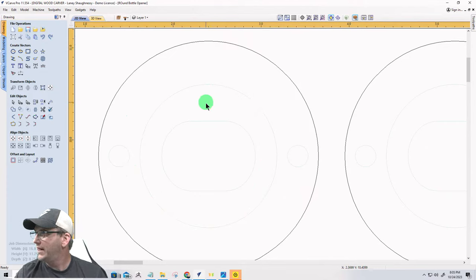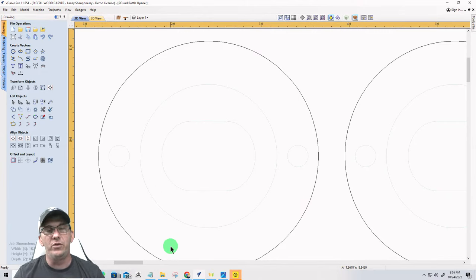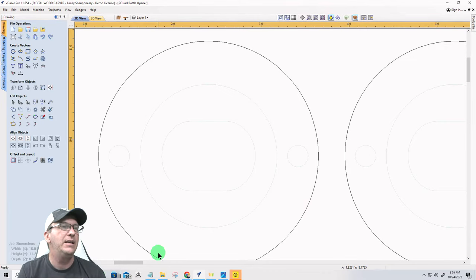Just remember, right in here at the top and the bottom, there is a screw going through 0.315 inches deep. Our insert is going to be flush with the bottom, so it is 0.315 inches deep when it's countersunk. If we have a half inch piece, that's less than 3/8, that still gives us about an eighth of an inch to work with before we expose some screw heads, or screw tips, I should say. If we're working with a 3/4 inch piece, then we have 3/8 of an inch of material to work with. So you think about what you want to do.